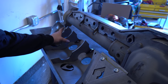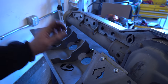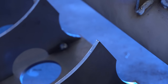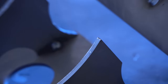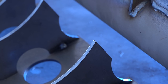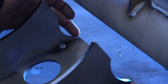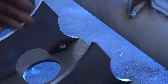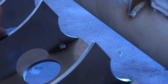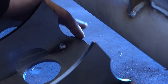I'm not quite satisfied with where these are at, so I'm going to grind off these tacks and move them back a little bit. You can see right here there's a little space, and I think they should be right up to that edge — that'll work best. So I'm going to untack these and re-tack them so that they're right on that edge.